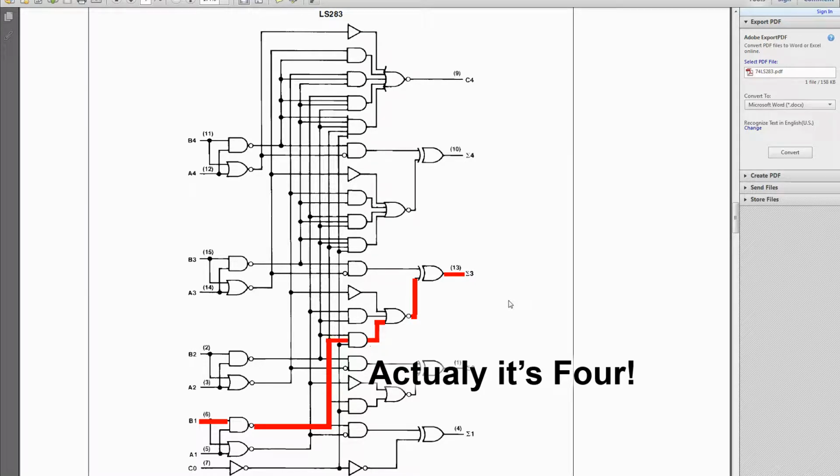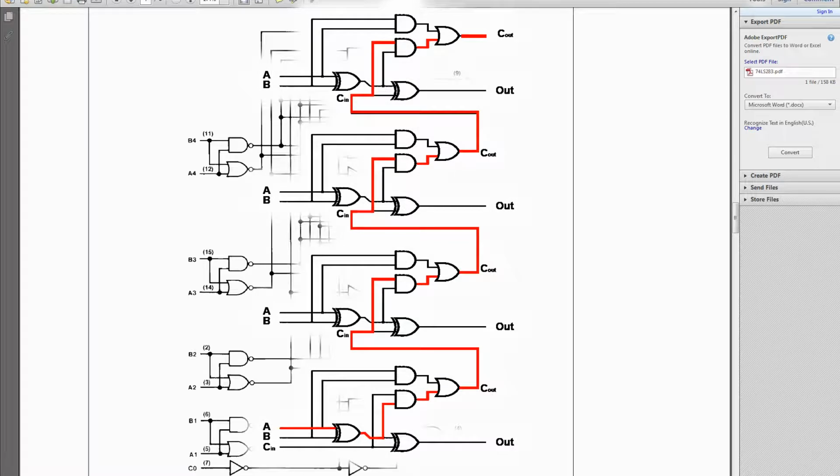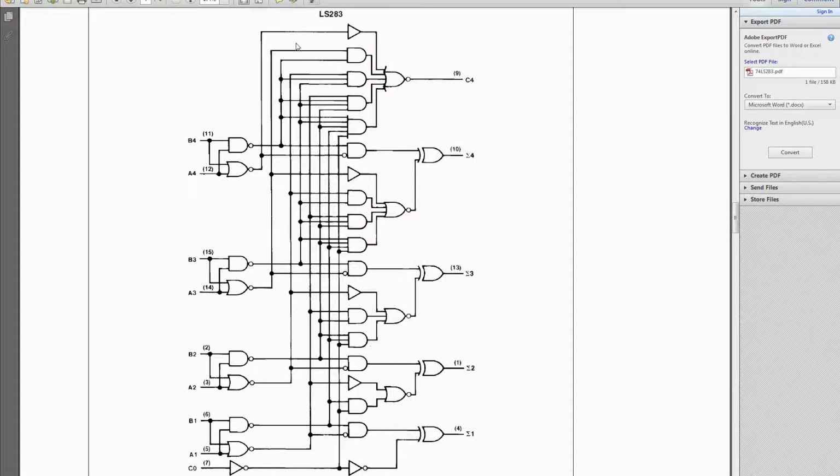Whereas if you did this with the classic single bit carry, then what you end up with is this first output bit is quite a short path from the 2 inputs and the carry in. But all the way up to the end here for the carry out, you have a kind of a cascading effect where you could end up lining half the logic gates in the circuit in a row, and you end up with quite a lot of latency before that final carry bit resolves.